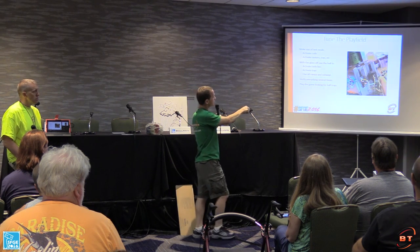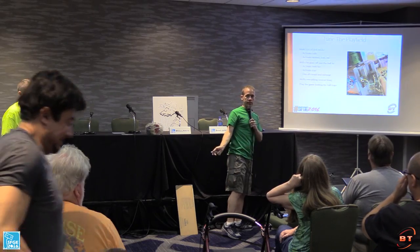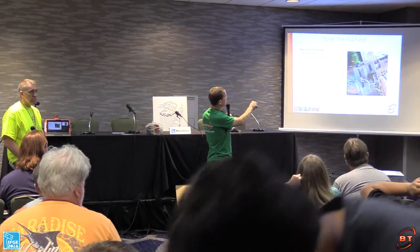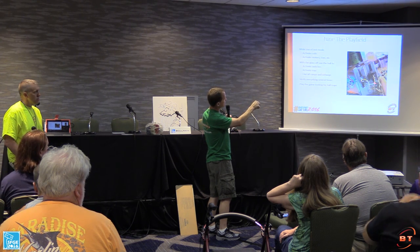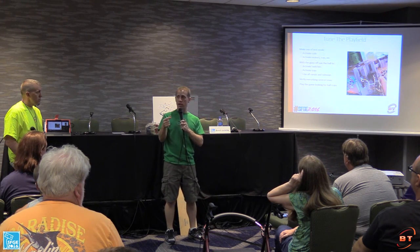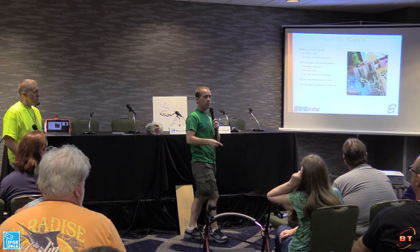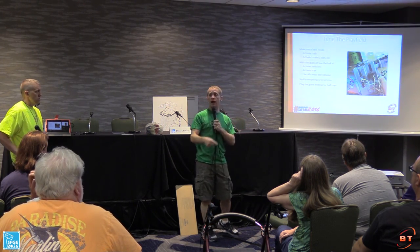And this is the swamp scoop on an Addams Family. It's on the lower right side of the play field. It's got two kickers in it, and it's got like four switches, and there's switches mounted on the side. I had a problem with that game where a ball would hang in it because I had the switch misadjusted, and the game couldn't read the ball there. So it would hang until it went into ball seek and kicked it out.